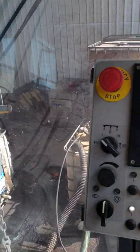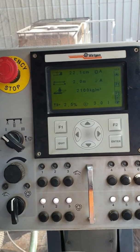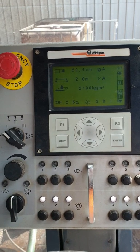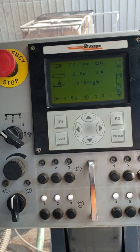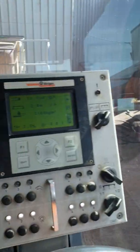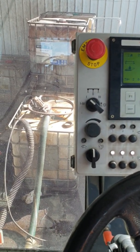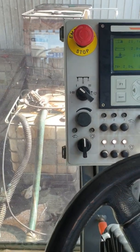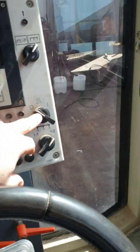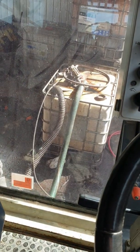The Pro Mass can also give you an error where you've exceeded the maximum amperage draw through the exciter coil. Apparently that's because kerosene isn't the correct medium to use. To stop that error, on this particular machine where the spray bar is, there's a small ball valve — I've just slightly turned it off, just a quarter of a turn, to slow down how fast the kerosene was moving through the system. I think the fluid was so low in viscosity that it was struggling to read the correct weight, considering bitumen is a lot heavier than kerosene. Also, kerosene is flammable — be careful not to turn your generator heat on. Most of the time you will need to turn it on to warm the pump up to get it spinning initially, so heat and kerosene is not ideal.